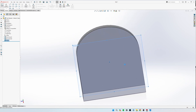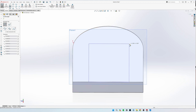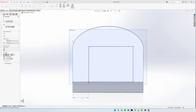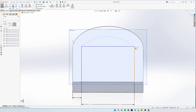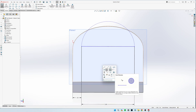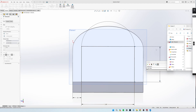We'll start a sketch on that plane and move it up a bit to see it better. Now we're going to draw a rectangle starting at this line and coming up. It is three inches wide and the total is four inches wide, so it's 0.5 inches on each side. We'll define this distance to this line as 0.5 and the width as three inches — that fully defines the width. Now we draw an arc on top — once again, make it tangent by selecting the point, holding Control, selecting the line, and choosing Coincident. Lastly, define this height, which is 2.5 inches.